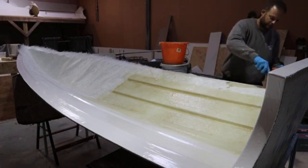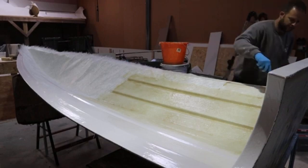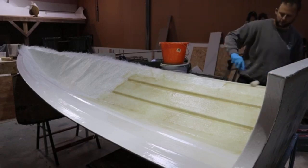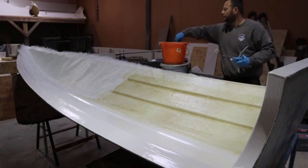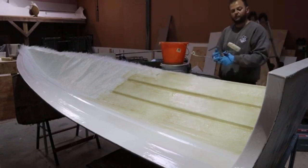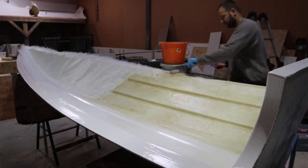Again, I only do that if I'm multi-layering, because the reaction overall is an exothermic reaction. And what it will do is create heat. The more heat that is created, the faster the product will cure, the faster the product will react. Okay, so that's why. So if you're multi-layering, say you put the 3 layers on at once, tend to drop the catalyst down to 1% so that you have more working time. Because this is a race against the clock, so to speak.